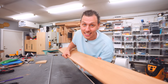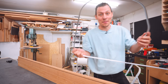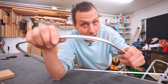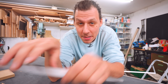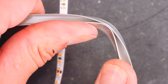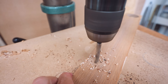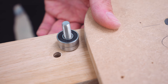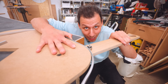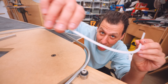The next challenge is that we've got a curved groove and we need to fit a straight piece of aluminum track into it. I thought it was pretty thin so I should be able to just carefully bend it by hand. But the problem is because it's hollow in the middle, as you bend it the channel collapses, which means that we can't fit neither the light nor the diffuser. My next solution was a contraption — if you evenly bend the channel around a curve, it wouldn't buckle in on itself. This thing has the right curve with a couple of bearings, but it still collapsed a little bit, causing the diffuser not to fit inside anymore.